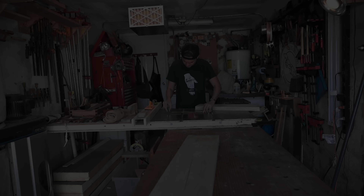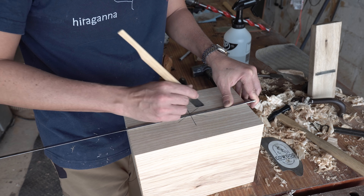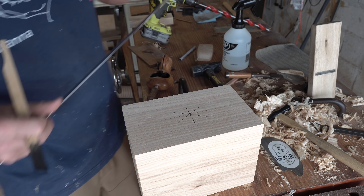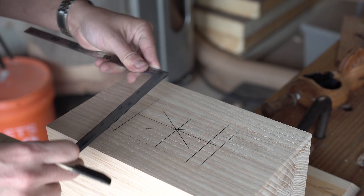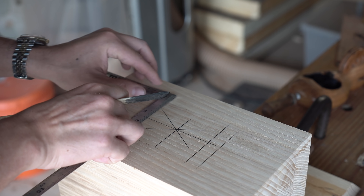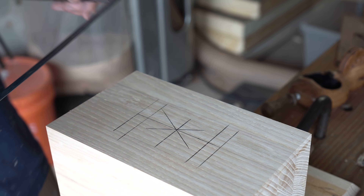The layout with almost all joinery and timber framing processes is the most tedious but candidly the most important. I'm marking out on top and bottom where the mortise for the handle will be. I begin by marking center and then from that center point crossing through it from end to end and side to side. I use those lines as guides to mark the width and length of the mortise and then square those off to match the stock I'm using for the handle.